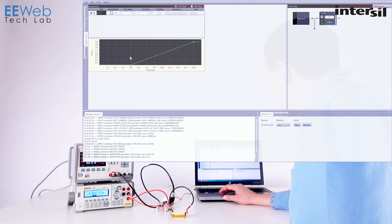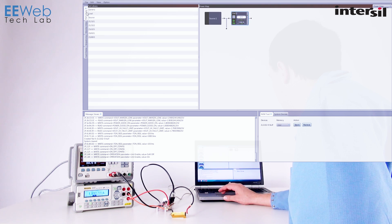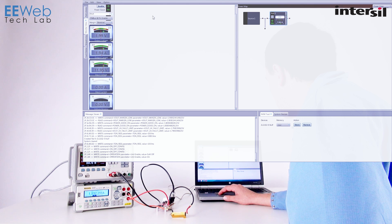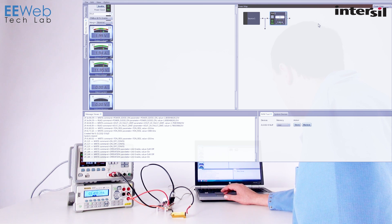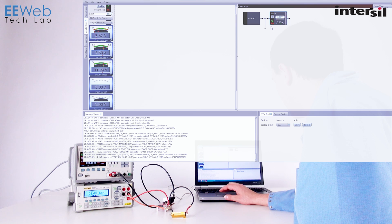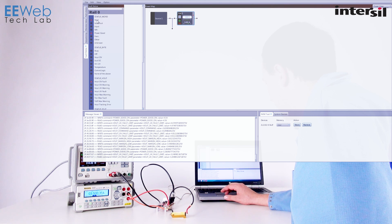We can also come in here and check the fault status. Right now there are no faults, which is a good thing. If we try to set it to a voltage that it simply won't do — let's set it to 5 volts — I don't think the supply is set up to supply enough current right now. You'll see it's limited at 3.6 amps, it's undercurrent, and it's flagging an error on the voltage. If we go into the fault status you'll see V out power good, V out over voltage fault, and V out under voltage fault. Apparently when I tried to set it to 5 volts it just could not hit that voltage.